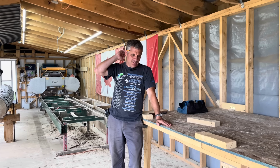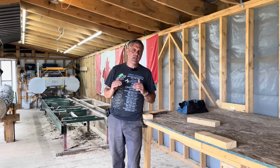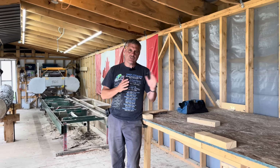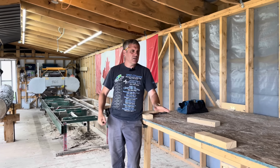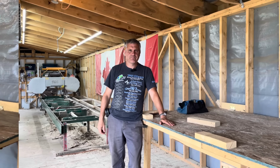I've facilitated that process, especially for the trusses, by building all the jigs for the pieces, the webs, the top and bottom cords, and I built a table that can be lowered and raised when not used, to speed up the process of building these trusses. So let's make a few trusses and I'll show you how I make easy trusses for the shed.